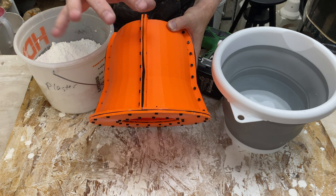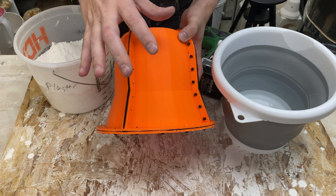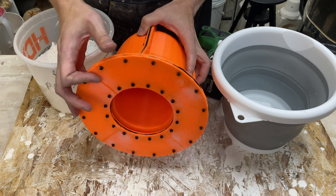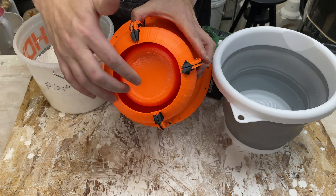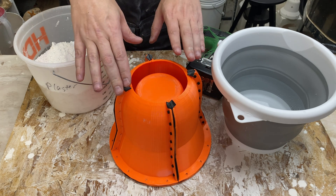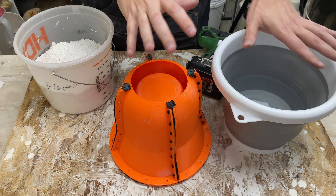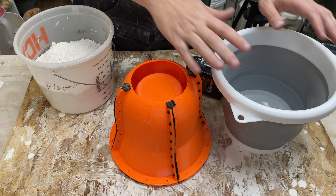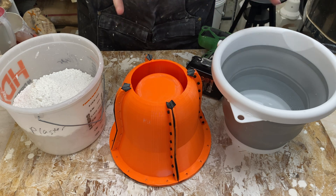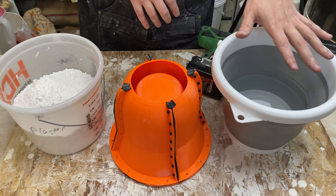All the bolts are tightened down — be careful not to overtighten as the 3D print can be brittle and you don't want to crack it, which would let plaster out. You just want to make sure the gasket is snug all the way around. And there's our cavity. Since the software is doing all the modeling, it also handles the plaster calculations. This cavity takes just over two liters of plaster, compared to 3.67 liters for my old mold — a significant saving with almost the same inner form. The software calculates how much water and dry plaster I need and rounds up slightly to ensure a little extra.